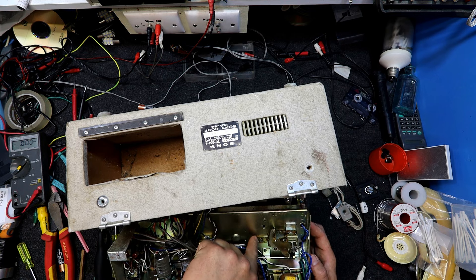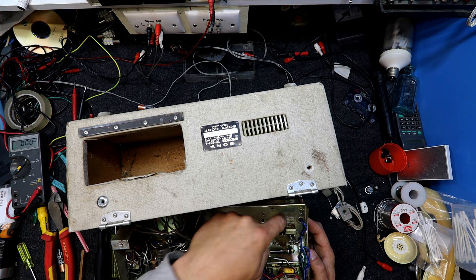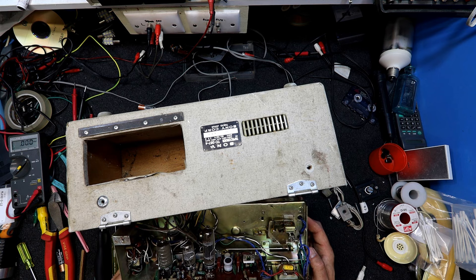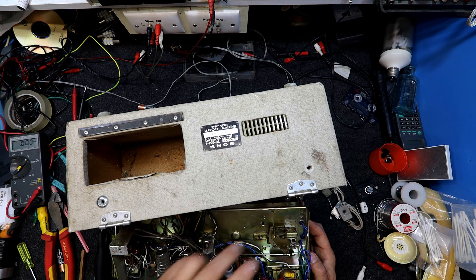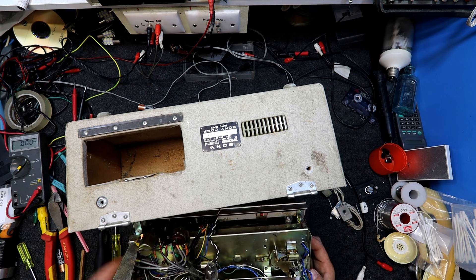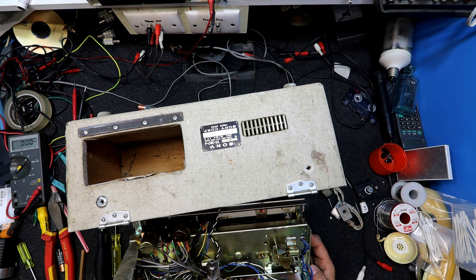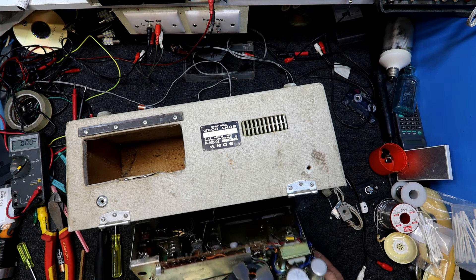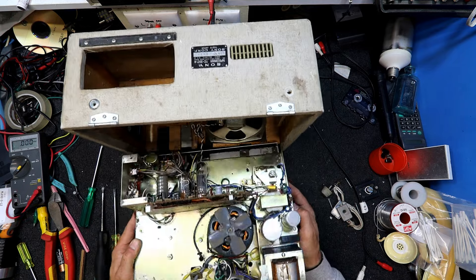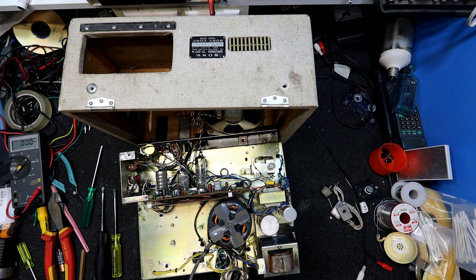The grease is actually not too bad, at least on that bit — not completely sticky. There's a big incandescent globe down there, and what looks like a potentiometer in a weird case — not a multi-layer pot. A great big motor with a motor start capacitor to run the motor. And a couple of electrolytics for the main rails — possibly a speaker output transformer.